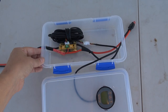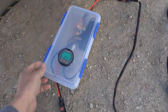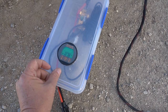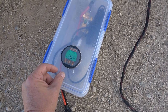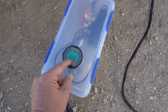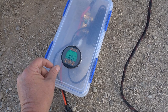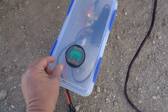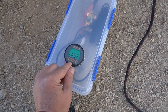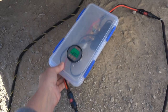We'll pop it together and I'll give you a demo — just like so. Now it's hooked in-line and I can take a look at this meter. Right now you can see 12.78 amps going through, coming out of the solar array. If I press voltage, it says 36.25 — so the voltage is fluctuating around 36.5 volts and 12.6 amps. Multiply those two figures together and you get the wattage.